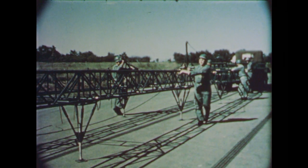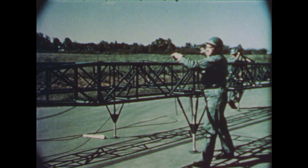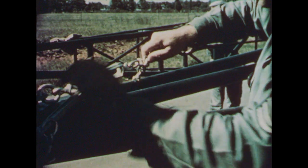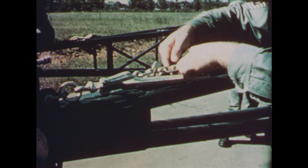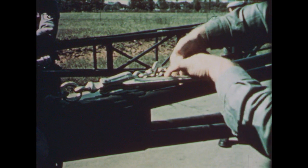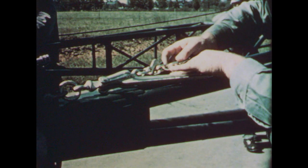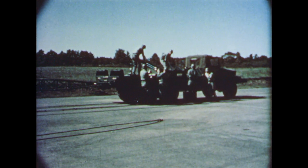The tension cable is now lying along the top of the H-frame from the truck to the cable support and toward the launcher ring. A load binder on the H-frame near the truck anchors and tightens the tension cable. The other cable end is anchored on the H-frame near the launcher trunnion. Thus, upward movement of the H-frame is counteracted.